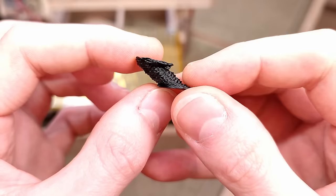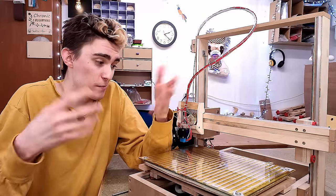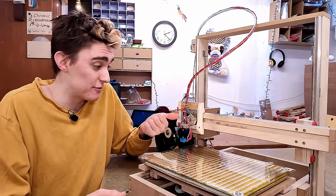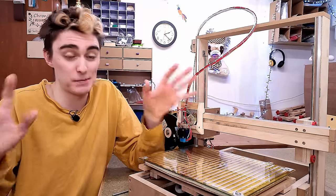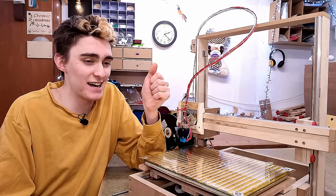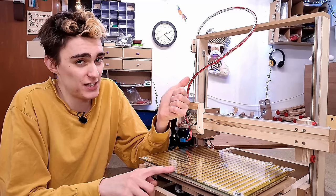Ultimately, it's still no good though, because it switches from kind of working a little bit to doing full steps when the motors are trying to go slow. Plus, I'm now also getting layer shift in all directions, what with microsteps having less torque, but it's very interesting nevertheless. There is two ways to go about improving this. I could either increase gear reduction, which I know you guys will love because it's totally in the spirit of RepRap, but this printer's obviously not very good at printing small gears yet.